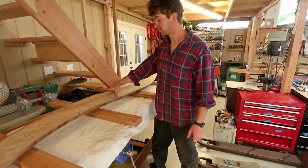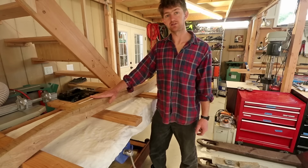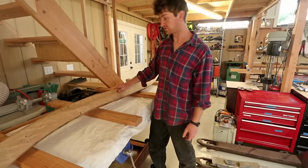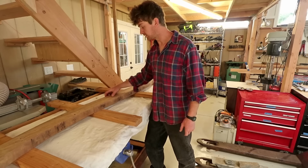In fact, Steve Cross, who is certainly one of the most knowledgeable people about live oak worldwide, disputes whether this should even be called sapwood in live oak, because it doesn't share that characteristic that sapwood has in most timbers. But it is a slightly different colour from the rest of the wood. Interestingly, with most timbers, the sapwood tends to be lighter than the heartwood, and in live oak, it's the other way around. So the wood on the edge is slightly darker than the heartwood.